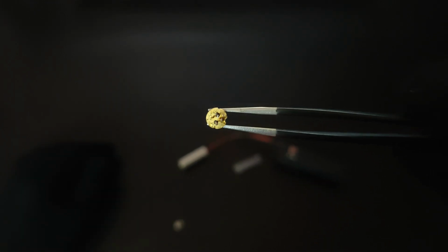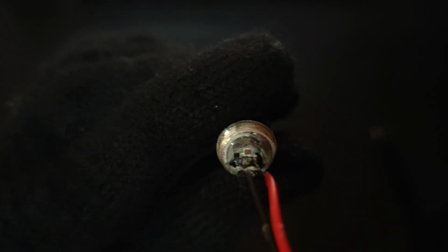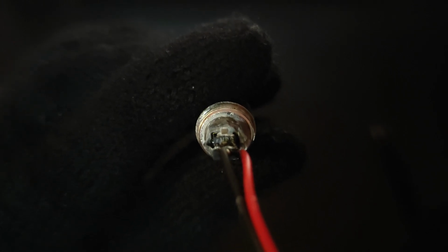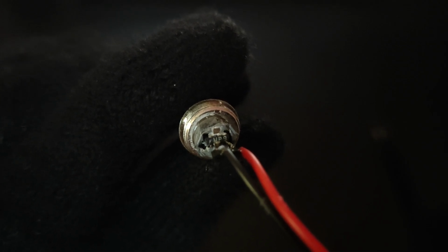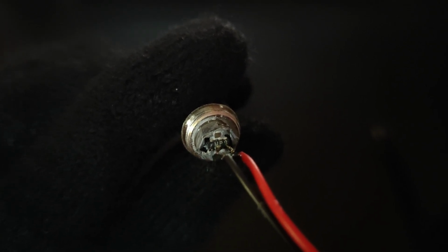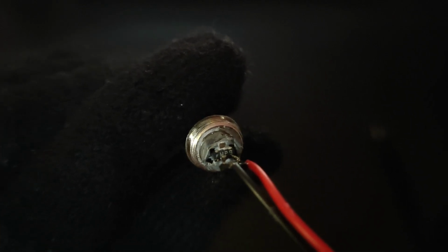If you don't see that, you either have the wrong pin or you're dealing with an infrared diode, which is used for reading and writing to CDs instead of the red one. So you can also use a multimeter to identify the infrared diode and the red diode in your drive. Now, in some cases, you're gonna find diodes that look completely different in your DVD drive. If you have a diode that looks something like this, in my opinion, it is ideal to leave it in the heatsink present inside of your DVD drive and just sand it down until it fits in the housing.